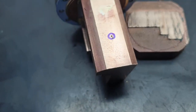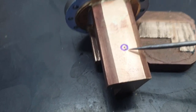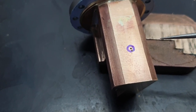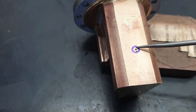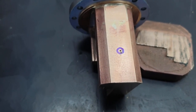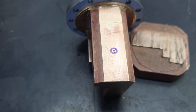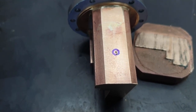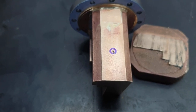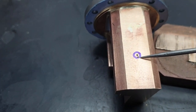Right, the original hole I encircled with felt pen, and as you can see there, if it focuses, that's where the actual position is, and I've measured that, and that difference is about 50 thou, which doesn't sound a lot, and considering that the steam pipe is fixed at the front end of the boiler, a good 7.5 inches away from this point, then it's not at all bad really. But it is the difference between something being slightly misaligned and leaking steam potentially, or being steam tight. So we won't go with the drawing position here, we'll go with this position here.